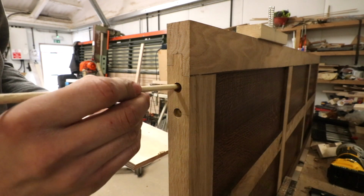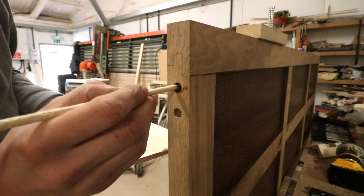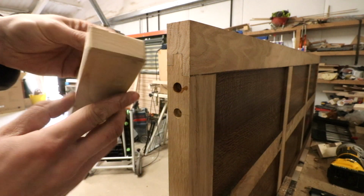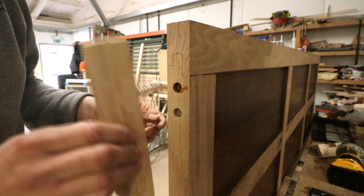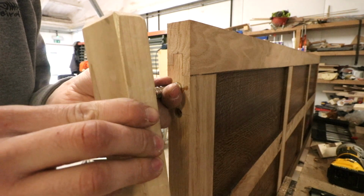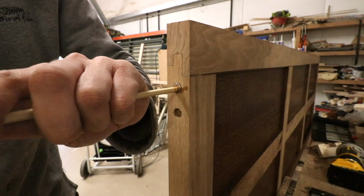I've got some clear glue here, some super glue. I'm just going to coat the inside of that housing with it, make sure it's all covered. Then we go back to our setting piece here. So this was a frame magnet setting piece. All the frame magnets are the same as this. So the frame will sit in this like orientation, so we can just sit it in like that. And that's our magnet set, and we know we've got the right orientation. Tap him home.